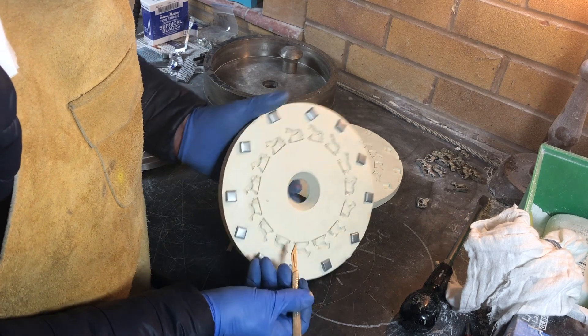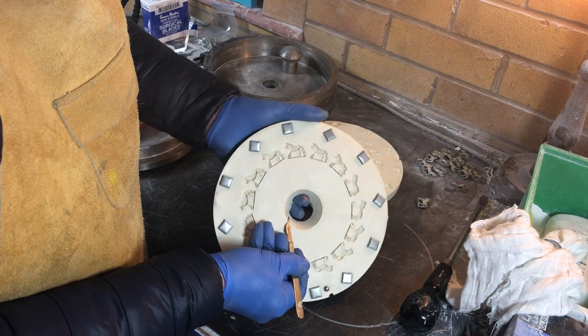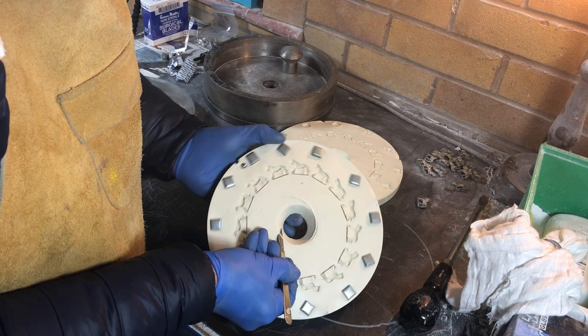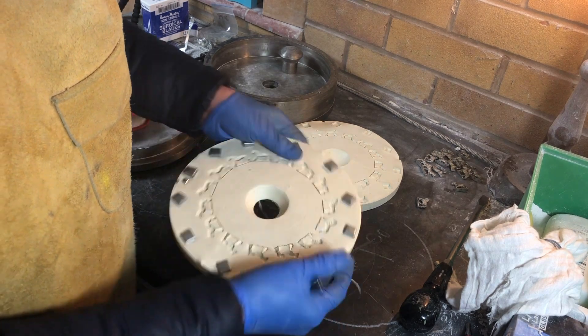Get a fresh blade out — a 10A, a very useful blade. I was originally taught to do this with a Stanley knife with breakable-section blades. They are basically a butcher's tool — they will do the job but quite crudely. This scalpel will allow you to do much finer work. The first thing to do — it's very hard to show because I'm right-handed — you just take off a little bit of excess rubber from the rounded edge of the mold. That'll help it lie flat in the casting machine. The mushroom can leave a little lip, and it's good practice to just take that little bit off — it probably means less mold catch and tear.